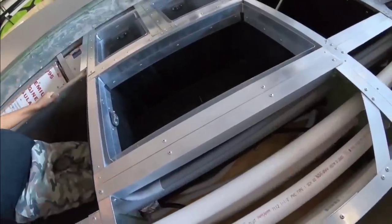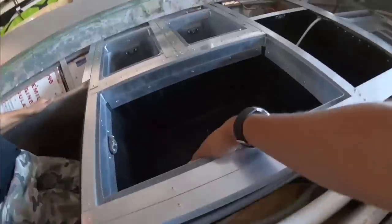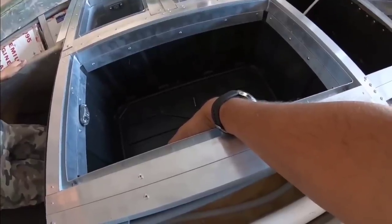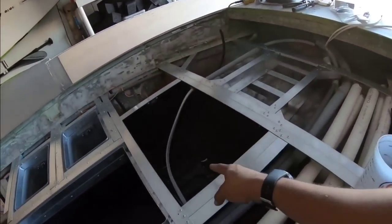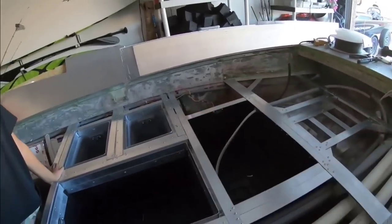When it does expand, if it's going to push against something that will flex, you need to have pressure there. So when it expands against the walls here and bloats them in, my son will be in there to press against them and hold them to shape until the foam stops expanding. At that point, it'll stay to fit, and these walls will be very, very stiff. Same thing down here. By the time everything's done, you can stand in these totes like nothing.